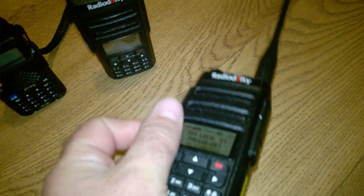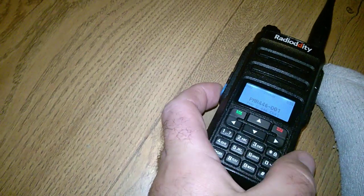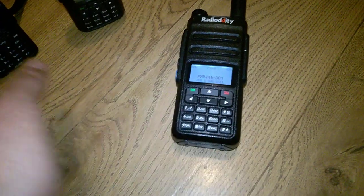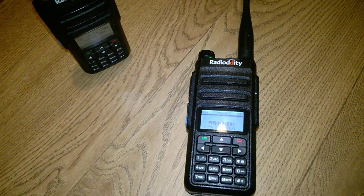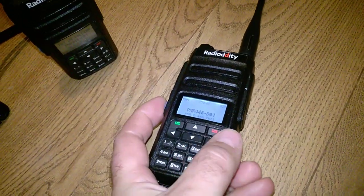The first thing you want to know is whether you're getting a DMR signal. The best way I've found to do that on virtually any radio is to switch it to FM. It might sound absolutely mad, but switch it to FM — and if you hear that noise, that is the reception of DMR.